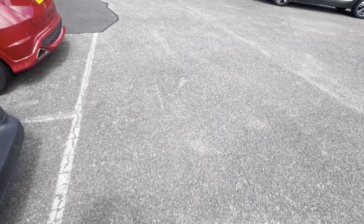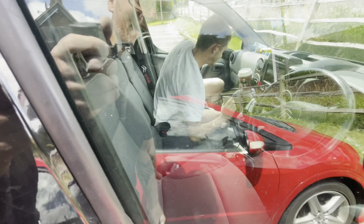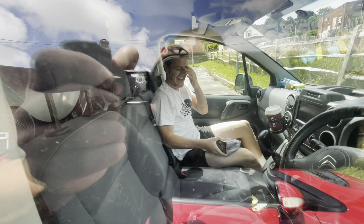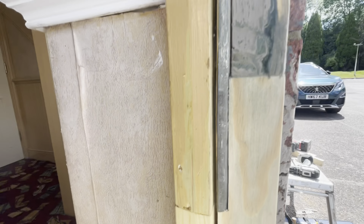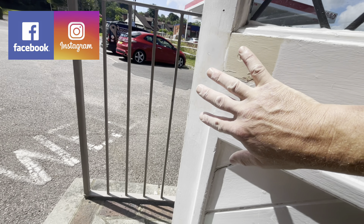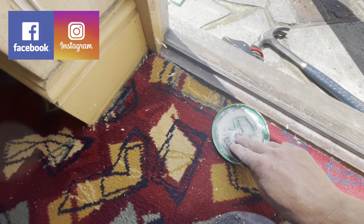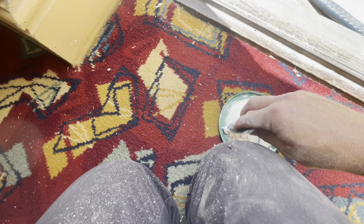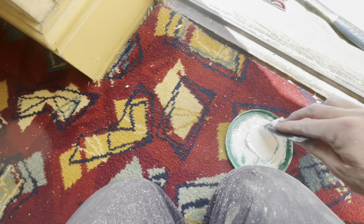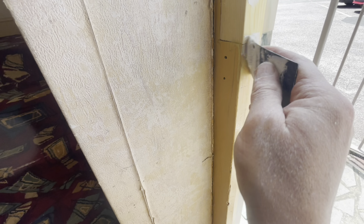Josh says he'll come and give me a hand. All that's sanded — just got to fill it. I've sanded this bit of filler down but this doesn't have to be perfect as it'll all be covered up. I just wanted to make sure it was filled before fitting the new lock, because it's a bit of a weak point there, and if there's too much of a gap or too many holes it's just not good, so it's better to fill it all and know it's solid.